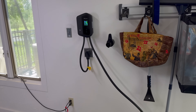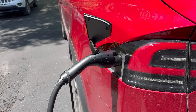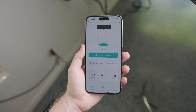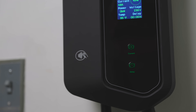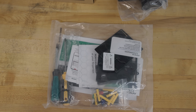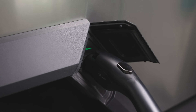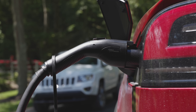There's also extra versatility with the Mach 1. There's a full-fledged companion app where you can start and stop charging sessions remotely, dig into info from previous sessions, and adjust power delivery. On the unit itself, beyond the real-time screen, there's extra functionality for sharing access. If you've got roommates, or if this is installed at a business or public location, there are RFID cards included in the box — give them to people you want to allow, they tap to authenticate, and charging commences. For home use, just use plug-and-play mode and plug in to start charging immediately.